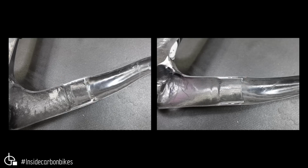Now I have seen over the years quite a few failures, crack indications, etc. at this junction on genuine Pinarellos, particularly on the non-drive side for some reason. Maybe it's the asymmetrical design which leads to that problem. I did one many years ago. I think it was a Pinarello Prince, probably around 2010 or something like that, and it had cracked on the non-drive side in that spot.